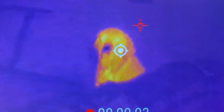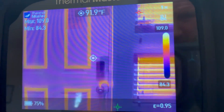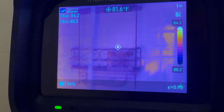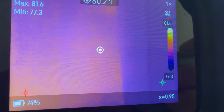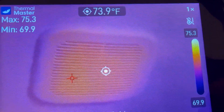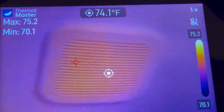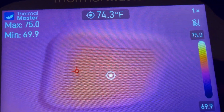There are so many uses for this camera around the home: get pictures of your dog, check your footprints, inspect door or window seal leaks, look for mold or cold spots that indicate moisture, and check for missing insulation in your walls. Here's my bathroom exhaust fan — it's not on, so that heat isn't from the motor; it's actually leakage from the attic through the fan ducting.